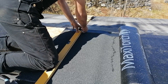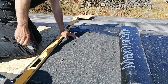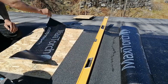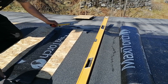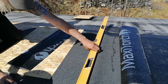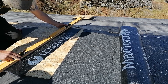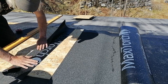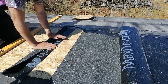I want the lap to be above, so the black strip has to be on the right-hand side. I'm marking 3 inches using a trowel to mark each end. I'm going to score a gentle line — you don't want to go through it, just score a gentle line — and then fold it on that line. You want to be as accurate as you can, really — both measuring, cutting, and folding. Otherwise edges don't meet, and it'll still be waterproof but it just won't look as nice. So that's the 3-inch fold to the edge of the roof on the drip, and then fold that again — that gives you the other 3 inches, and if you've cut everything right that leaves you 4 inches on the roof.